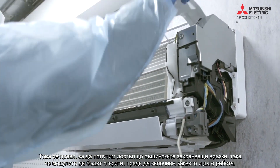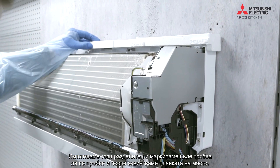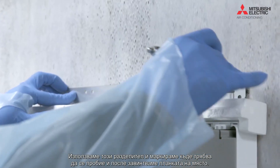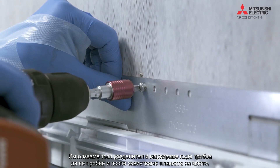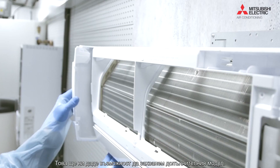The unit is isolated obviously before we're doing any of this work. We're using that spacer and marking on where the actual holding positions are, and then screwing that clamp in place. This is going to give us something to actually hook the plasma quad onto.